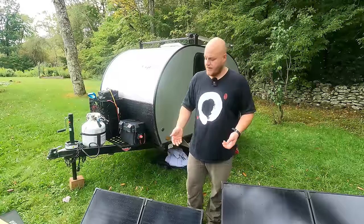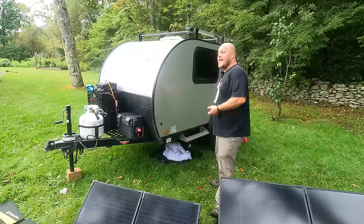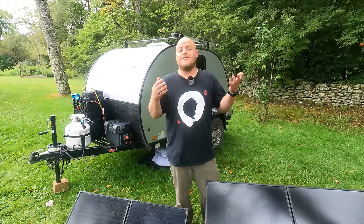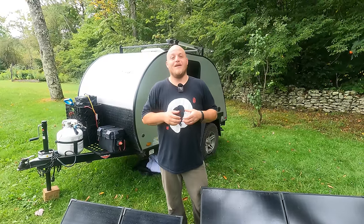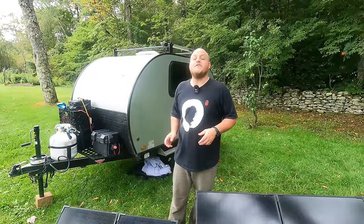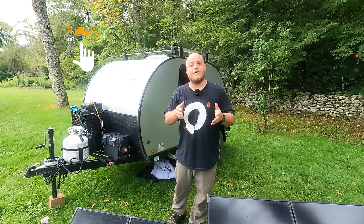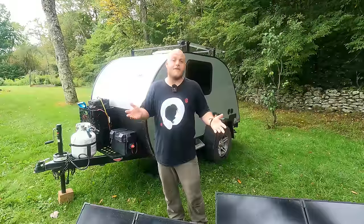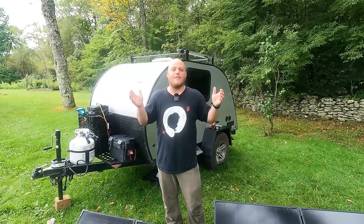Finding the right charge controller is even easier — just divide by 12 volts. If you have a 100 watt panel, a 10-amp charge controller can handle 120 watts. A 20-amp charge controller can handle 240 watts. That simple math is how you size these things together. I hope this was helpful. If you learn this, all the future videos about installing solar will make a lot more sense, and you'll be able to modify, adjust, or improve your current solar system. Check out my other videos — I'll be putting out a ton of content on solar. Thank you so much for watching, ask me a question in the comments, and I'll see you next time.